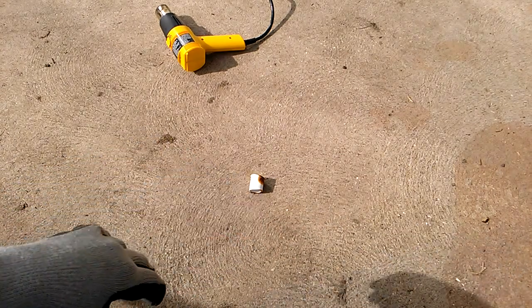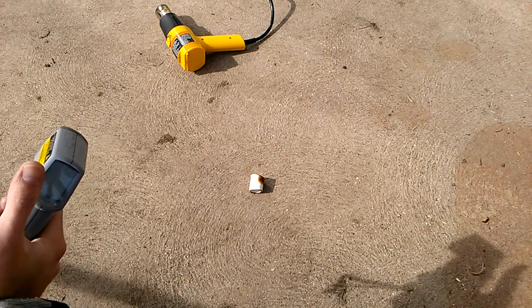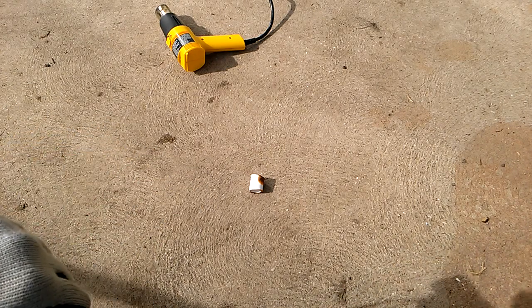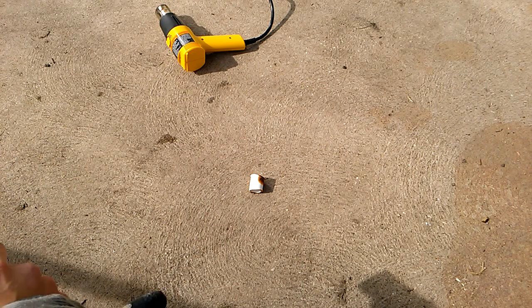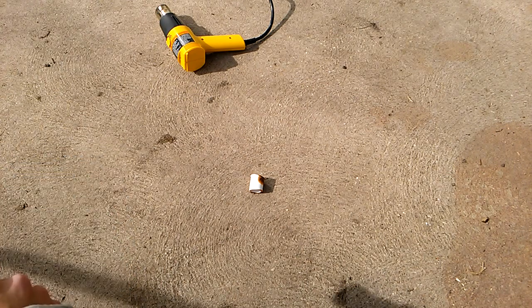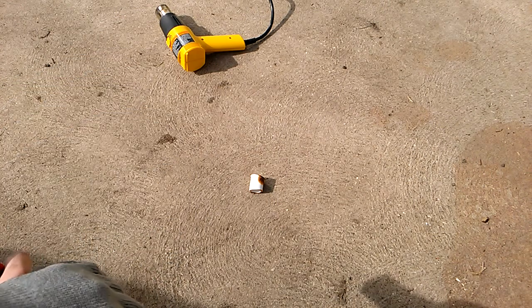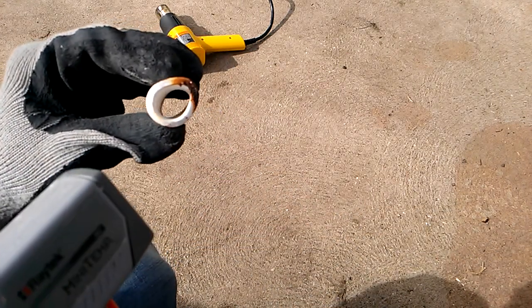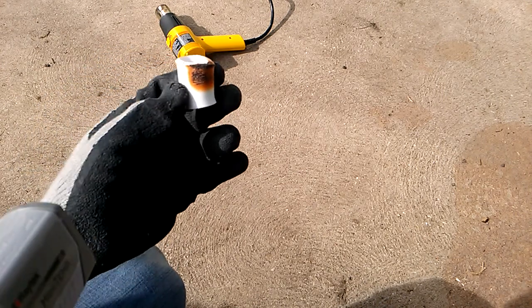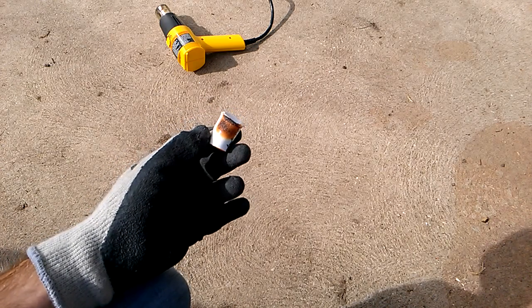So I think that pretty much tells you: up until about 230, you're going to achieve plasticity. Above 230, you're going to start cooking it. By 250–260, it's going to be boiling. The other thing to remember is the surface is always going to be way hotter than the core. If you just start to get this nutty brown — a very light brown — stop immediately. You can usually just rub that off, sand it off, and it'll be fine. But at this point, that's going to be baked almost all the way through, and that's unusable — it will fail there. I think Nick showed in one of his videos how it cracks, so I hope this has been fun and educational.